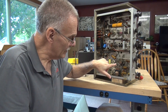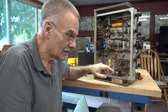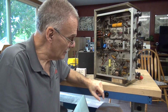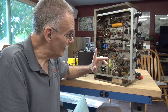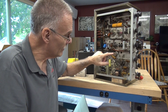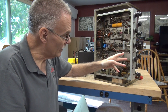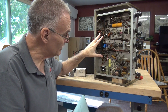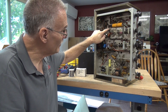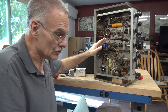First step, I'm going to get into the audio section. We're going to carve out all these wax caps and out-of-tolerance resistors, rebuild that, and then we'll test the audio. Then I'm going to pull out this monster TR relay, install the D-Lab module, and swing the wiring over, cleaning up this area. That will also entail removing this cap and these two diodes that are powering that push-to-talk system.